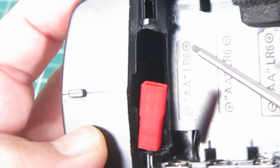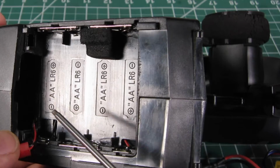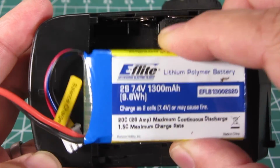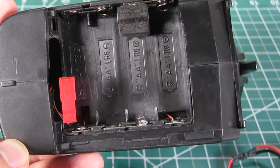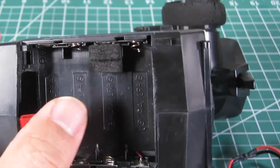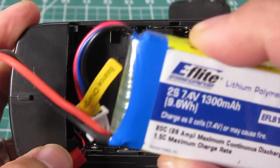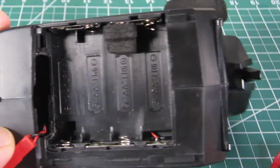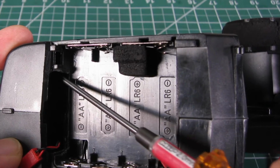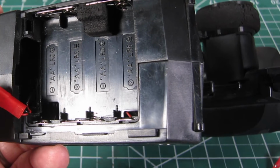Second, you'll need to cut away part of the battery tray to fit the new LiPo battery. The LiPo battery is slightly longer than the battery tray, one of the reasons why some folks use the smaller 650mAh LiPo battery. For the cutout, I measured the size of the hole using the battery and a marker, and used the Dremel and a wire cutter to cut away, and I finished off the edges using an X-Acto knife. Measure twice and cut once. You don't want to have the hole too big.